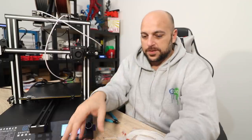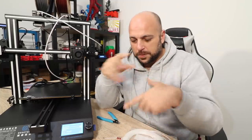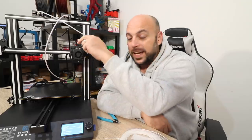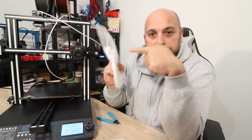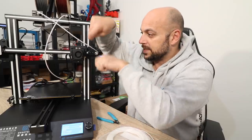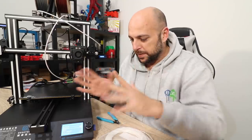I'm currently on a pause. First I had a couple of layer shifts, then I asked Filament Frenzy for his A10M profile and I'm tweaking it, trying a couple of small prints — same lizard, just smaller — to dial in the settings. The problem is I got a clog and the filament started skipping. This is not as easy to clear as a normal 3D printer, because you have one nozzle and two inlets — at some point there's a Y-shape which pushes down. If you try to put cleaning filament in, a clog in the nozzle will just push it up to the other end and vice versa. So I had to take the nozzle out, clean it, and make sure all the gunk was removed. Profile should be dialed in now — it was just that clog. I wanted to share the whole experience.